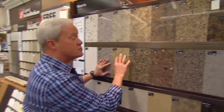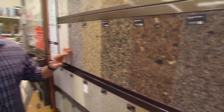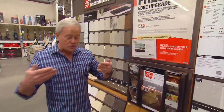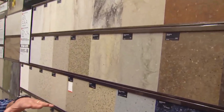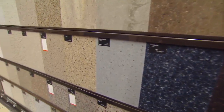Now, this is pretty cool because engineered stone doesn't require any sealing, whereas natural stone, like granite, does require you to seal it from time to time. But any of the materials that we looked at, if you seam them together, you'll see the seam — even though it'll be very subtle — unless you use a solid surface material. They're able to mold that together, you're still able to integrate a sink into it, and it's a great-looking countertop.